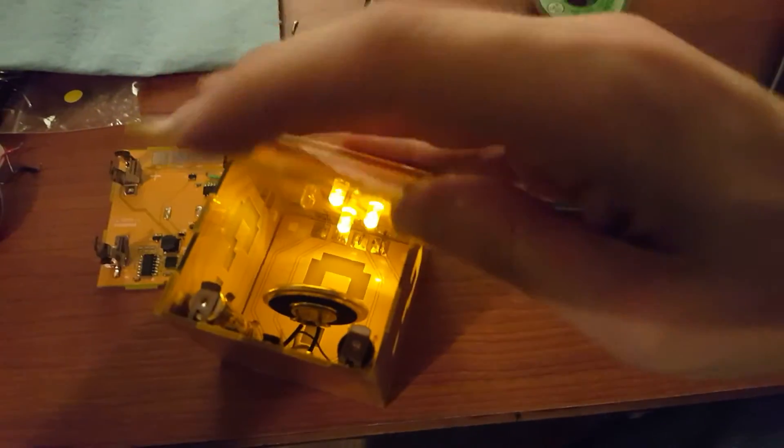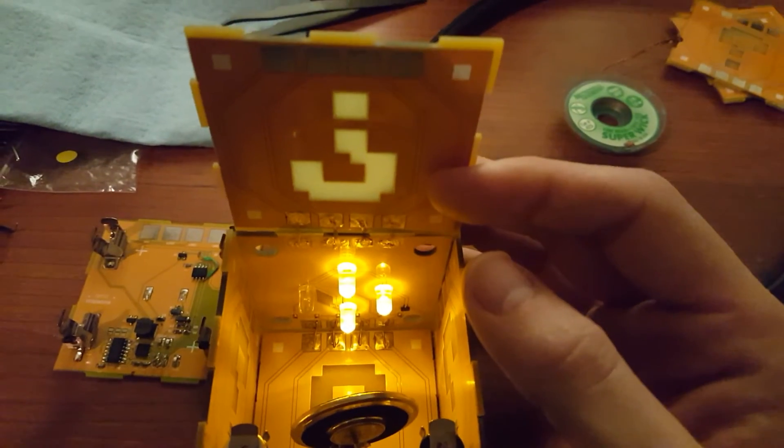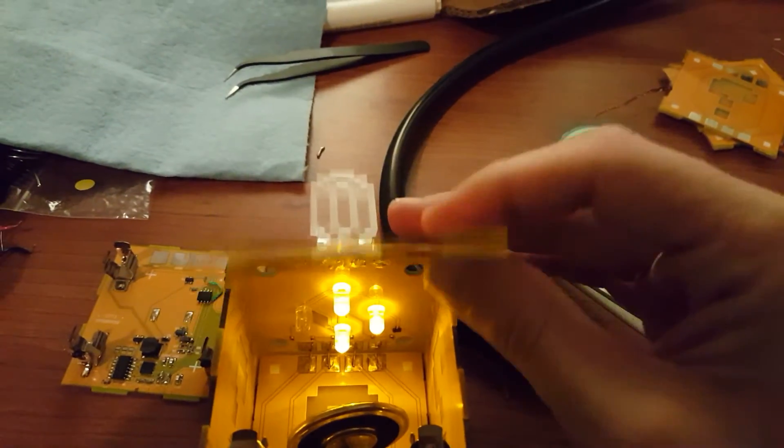But I still need a way to get into it to change out the batteries. So up at the top here where those four pads were — they weren't being used for electrical connectivity on this side, they're just routed along the back there. So on the front here I've used some solder wick on those pads to make a little hinge, so I can open it up.